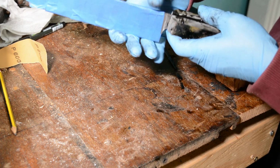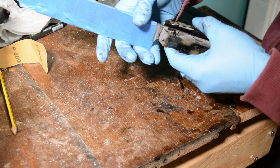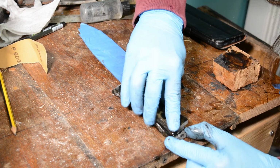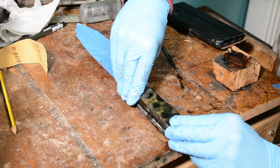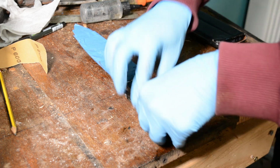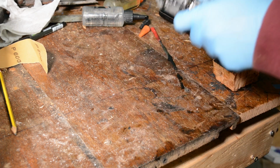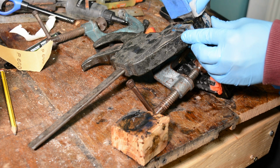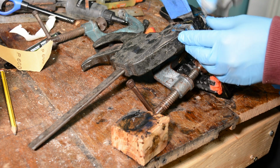But if you take a special handle material like this, even though it's synthetic, it still looks really good and there's a lot of effort in there. I just don't want to spoil it with pins. And this is the other half of the reason that you want locator pins. You can see once you've got glue in there, everything just becomes a slip and slide. If you had to try and line that up by eye, you're going to make your life miserable.